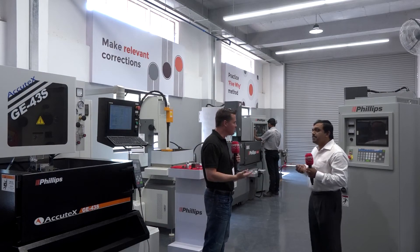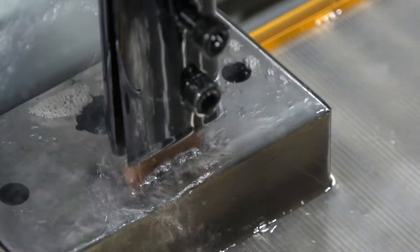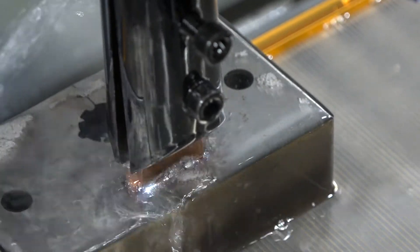EDM really reduces the amount of scrap we create too. In EDM, we are going to burn the material - it will burn and come out as carbon or ash. Whereas in a VMC, material comes out as chips. So in EDM, carbon comes out, and we provide coolant flushing which removes the ashes or carbon from the particular area, so we can provide more current to remove more material and finish the process.